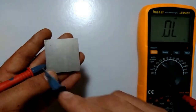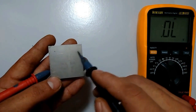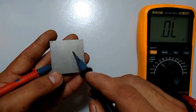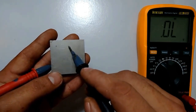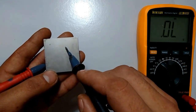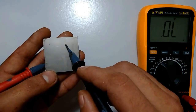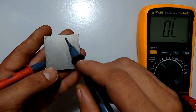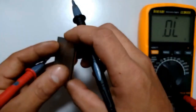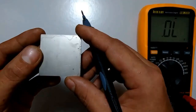If you start blowing a lot of heat here, it will create steam underneath, where the memory balls are. It will create steam. And until you hear a crackling sound, a pop. If you look when you remove the RSX at the edges, on the sides of these memories, if there is any little ball of solder, any spot of tin, you can be sure that the RSX is damaged, right? So I think you got a good understanding of the test, right?